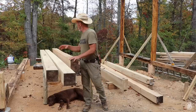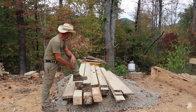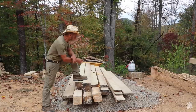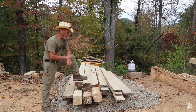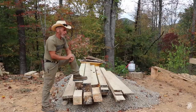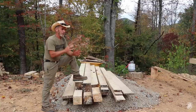I've got two sixteen-foot six by sixes here, one laying there, a couple of twelve-footers we've cut, one ten-footer, and I think three twelve-foot six by sixes. I've got a two by eight, six or seven two by sixes, and some one-by material that came out as we cut through those six by six posts. These logs aren't too big, but I've got some much larger ones down there — I need ten two by tens for the floor joists and I think I'll be able to get those out of the bigger logs.